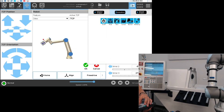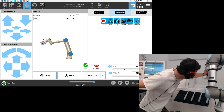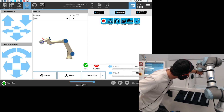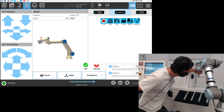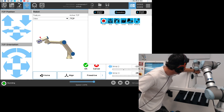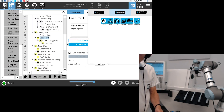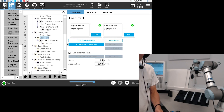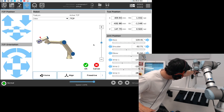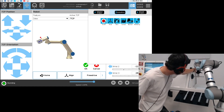Next I'm going to set the final waypoint — basically where I want the part to be when it's going to be machined. I'll insert it into the work holding a few inches in, set my position, and then use the active drive in three degrees of freedom to set my approach position, which should be just a few inches in front of the work holding.